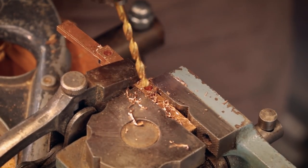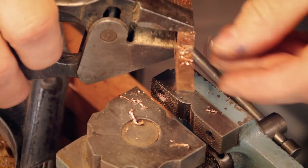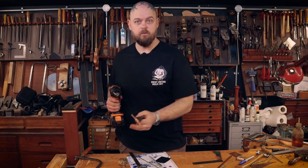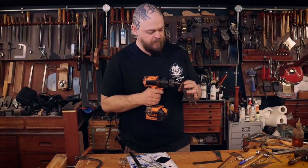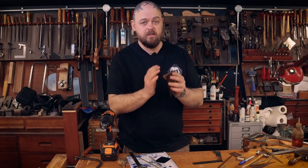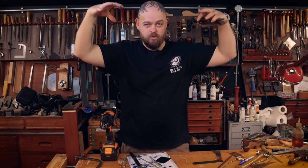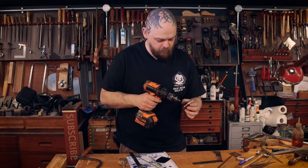That's not supported — we're almost there. I need to put this more central so the top and bottom sections are supported more. Worked out okay though. The next stage is to put a countersink in the drill and very lightly countersink around the outside of each of these holes. That's to give the brass rod somewhere to bite into as we pin it over — essentially a double-sided countersink shape. We're riveting this together, people.